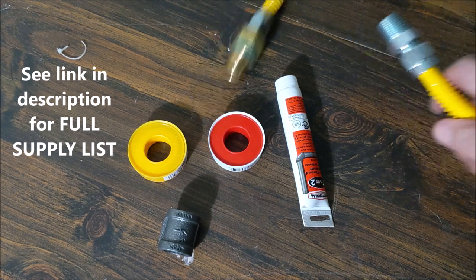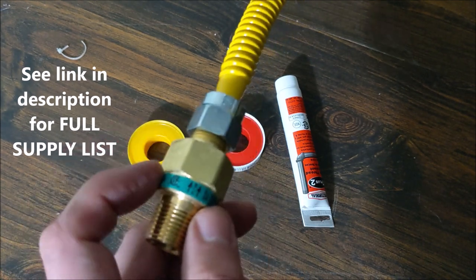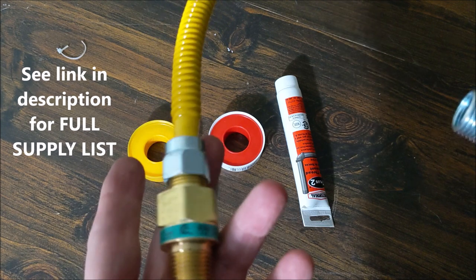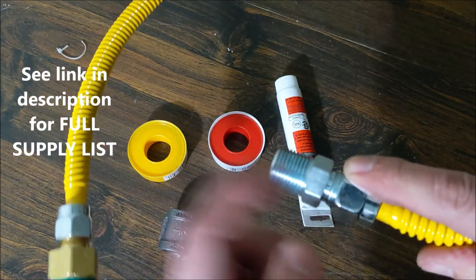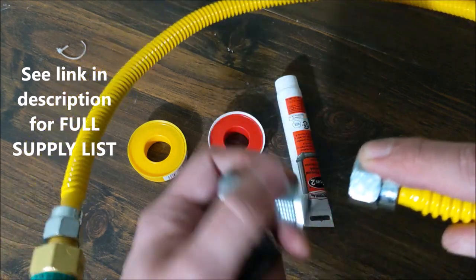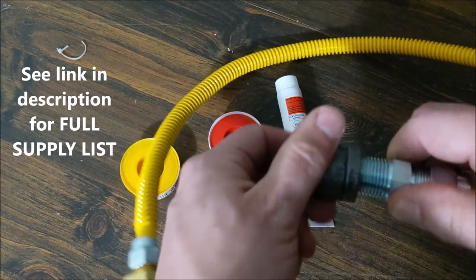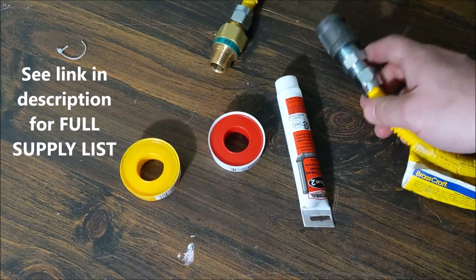The same thing goes for your gas line — I do recommend you have this, and I'll tell you more about it in the description. This is where it connects into the water heater, coming from your gas line. I strongly recommend you change your flexible gas connecting pipe since you're already doing the install. You'll need an adapter and a coupling, because the direct line cannot connect into your water heater. The coupling is what allows the connection to happen between the water heater and your actual pipe.